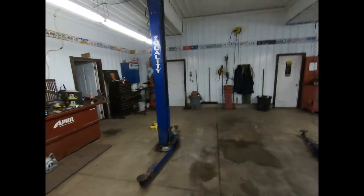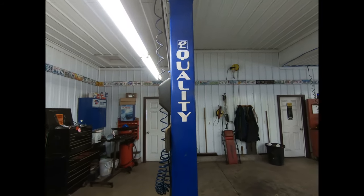Having a lower ceiling — as low as you can possibly go before it becomes intrusive — is key to making sure you're not spending thousands and thousands of dollars in heating fuel to heat your garage. We only opted to go with the 12-foot section here, and that's one of the determining factors of why we only went with the 10-foot ceiling everywhere else. In small business, you've got to save everywhere you can. Another area that we saved was in this Quality lift. I don't say quality just because it's a good quality lift — that is the brand name of this lift. Quality is kind of an off-brand of Rotary, and Rotary has been known for a long time as one of the name brands in lifts.